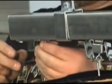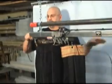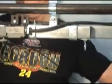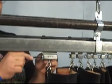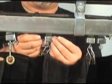When you get to the dead end pulley, thread the cable around the pulley and back toward the center overlap of the track system. Thread the cable through the 1709 end stop on the machine half of the track system at the overlap. Grab two more C-98 connectors, thread the cable through the dead end side of the second or non-tripping master carrier, then thread the cable through the two connectors. Continue threading the cable through the single carriers and backpack guides of the track system until you reach the machine.